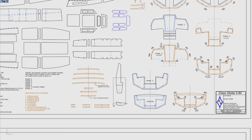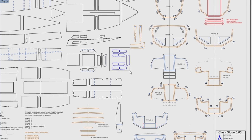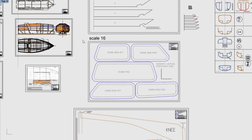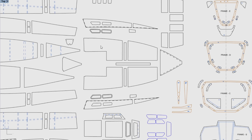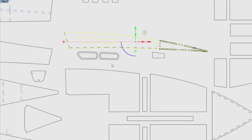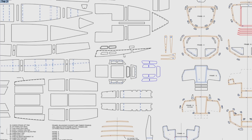We've also included plywood templates for the skeg and rudder, which we were able to fit in the sheets. There are also polycarbonate shapes for the port lights provided at one-to-one scale if you want to cut your own. If you want different ports, just contact your kit manufacturer and ask for a shear strake panel without cutouts, then put in your own ports of whatever size you prefer.